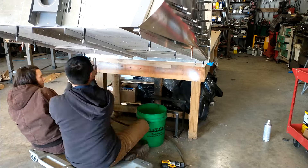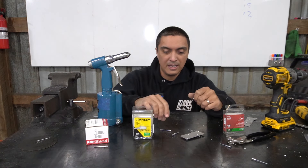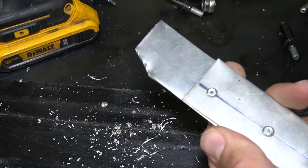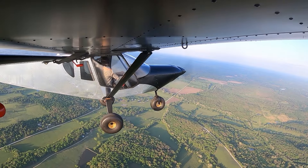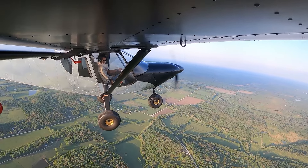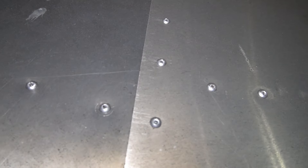I'm not saying these soft rivets are bad by any means. There are some applications where they're better than the AVEX rivet. If you're putting together any kind of plastic or soft material like fiberglass, the AVEX rivets take enough force to set that you will actually deform the plastic, if not crush it, and some plastics will actually crack. If you look at a Zenith aircraft, it's got a plexiglass windshield and Lexan side doors — those are all held in with soft rivets because they take much less force to crush and are perfectly adequate for non-structural situations. Everywhere structural, it's got an AVEX rivet — either one of these aluminum ones, a stainless rivet, or a traditional bucked aircraft rivet, a solid rivet.